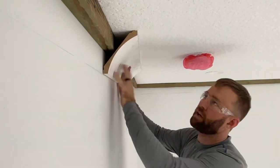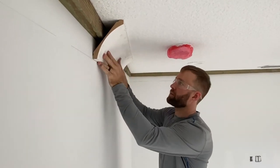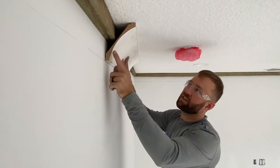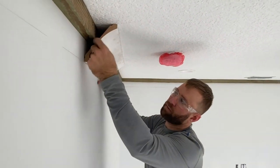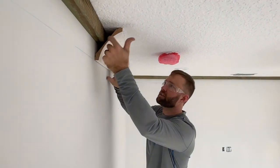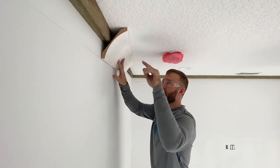The markings are right at the spring angle on the crown, which you can actually feel whenever we push at the bottom here — that's where the crown is going to sit. You can see we measured precisely to get these to perfectly fit behind here. We still have a little bit of space so we can tweak and adjust them as needed, but that there is going to be our nailer plates.